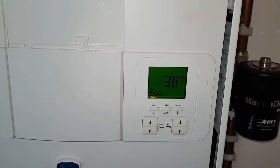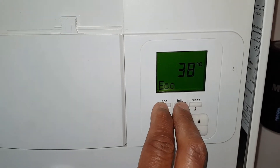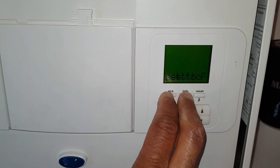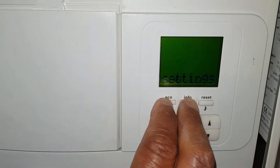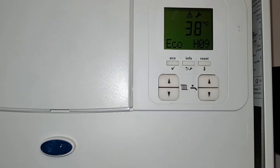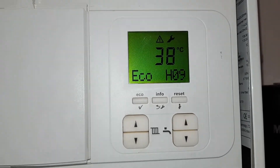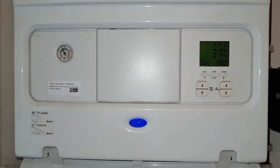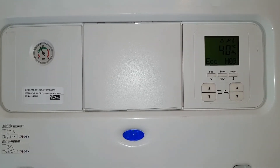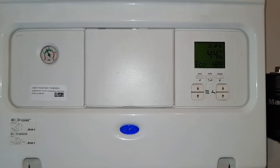What we're going to do now is try a factory reset by holding these two buttons for about eight seconds. You can see the factory settings going across the display, then I pressed the tick button — that should have cleared the fault, but it's still showing the fault. So we've put the boiler back together. The conclusion is the boiler works, but intermittently the power is being cut to the pump from the PCB — so it needs a new PCB. That's as far as we can go with it today. See you in the next video, bye for now.